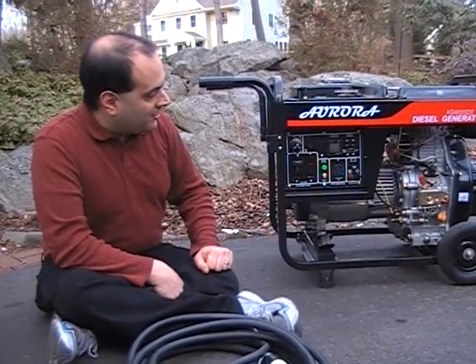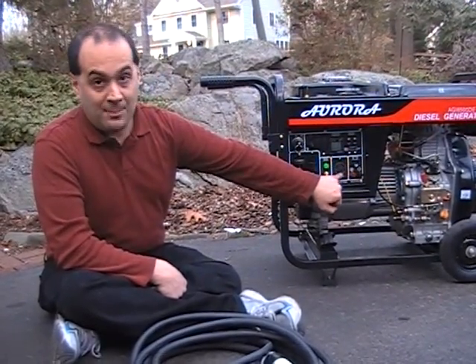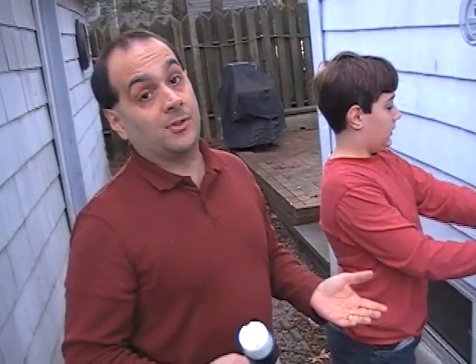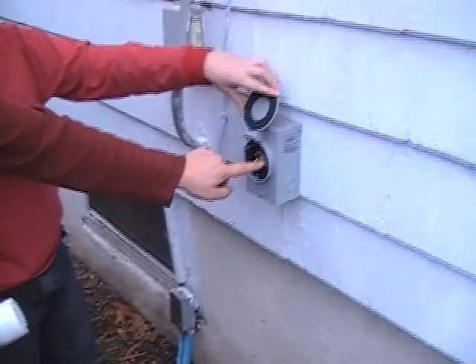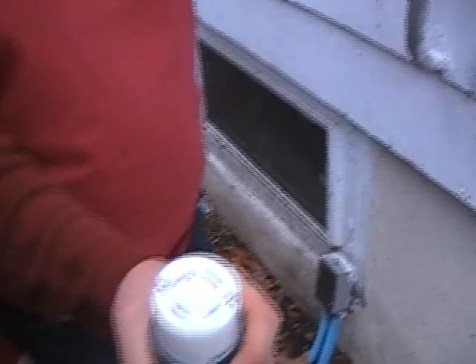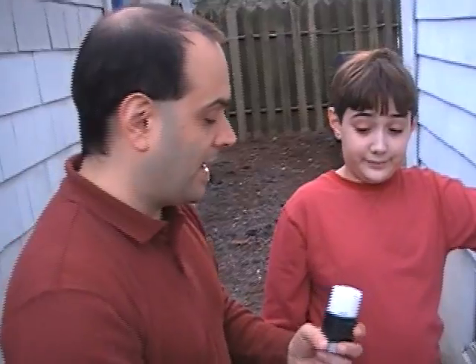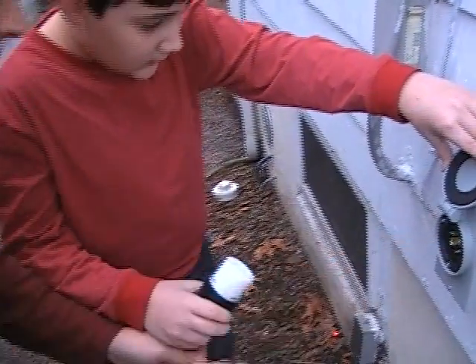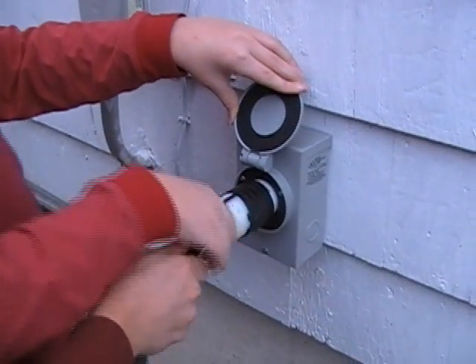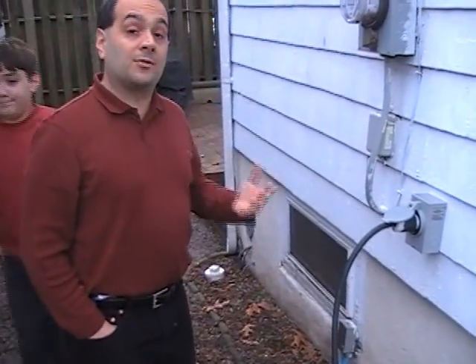This model is diesel, 6,500 watts, with an output of 120/240 volts at 30 amps — that means a 30-amp twist-lock receptacle. If you're going to do a manual transfer switch, all methods involve putting an inlet receptacle on the side of your house. An inlet is different from an outlet because the prongs are male — you always use male prongs for inlets, female for outputs. This is called an L14-30. You match up the bent 90-degree prong, push it all the way in, then turn it to the right about 15 degrees to lock it.